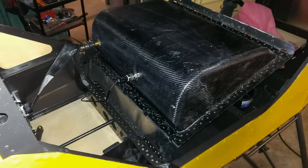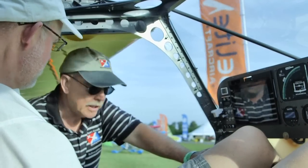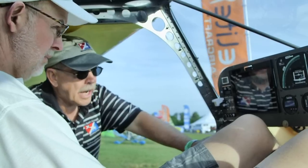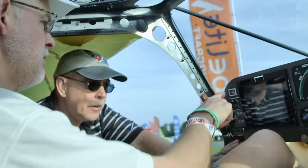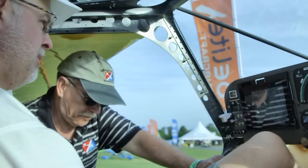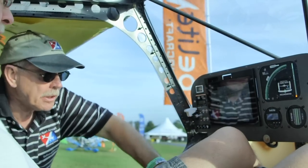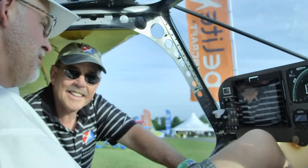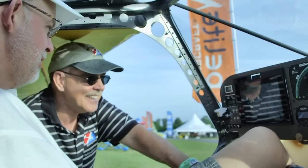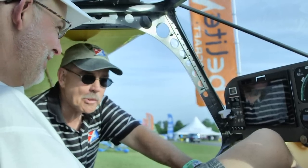Where is the fuel in this airplane? I'm sitting on it — there's a seat tank that we designed and built ourselves, a carbon fiber tank behind the seat. It weighs about four pounds and holds five gallons, just like it should in an ultralight. As for the iPad, we bought the dock to show how to do glass navigation in an ultralight using the iPad's own internal GPS. You could pop that out and use it for movies or email — it's set up on the cellular connection, you can update charts. If you buy the plane, the iPad is not included.